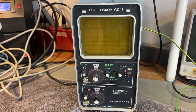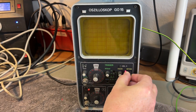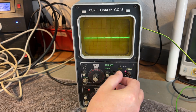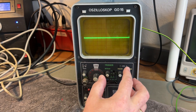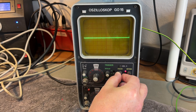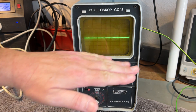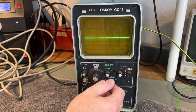I normally test all stuff like this at a little bit under voltage. Today we run — oh, look at that! We run at 230, but I prefer to use 220 because this is what it was designed for. Nice beam focus — look at that. This is also a very, very good indication. Everything is good and fine if you have focus in the middle. I also feel the beam is a little bit tilted, so we need to work with that.